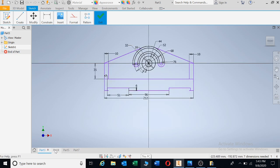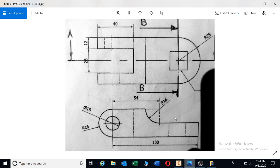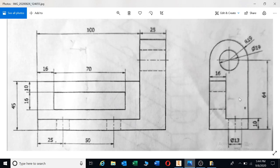I'm going to show you a couple more simple extrusions — all these drawings are simple extrusions which will just go one direction. Let me look for the drawing in my drawing database. I've drawn up this shape — if I'd drawn that other one I would have had to extrude those distances to the side. This one has less line work, so you extrude this L-shape based on that thickness, and then extrude that wall based on the 16mm thickness. The width there is the diameter of 38, which is a radius of 19.